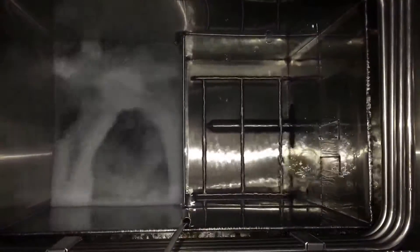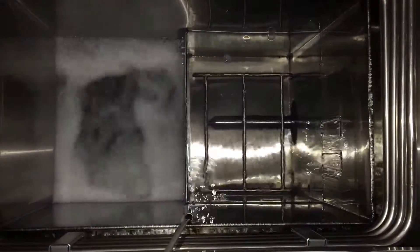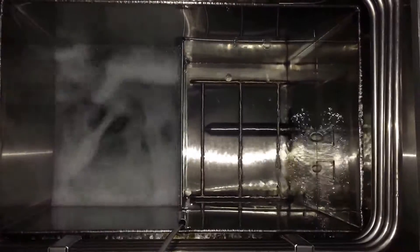On the right hand side you can see two little slots on the right hand side wall and solvent dripping down into the rinse sump. The rinse sump will overflow back into the boil sump and the cycle will start over and over in a full distillation cycle.